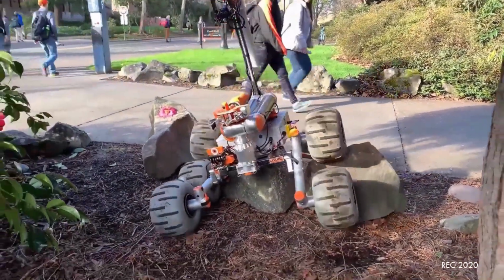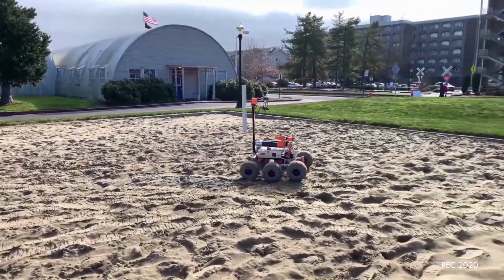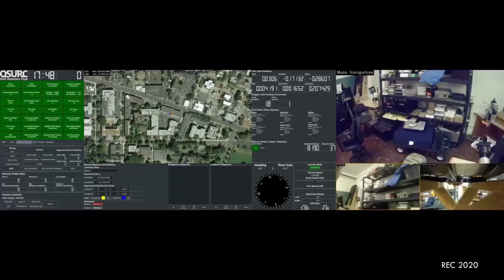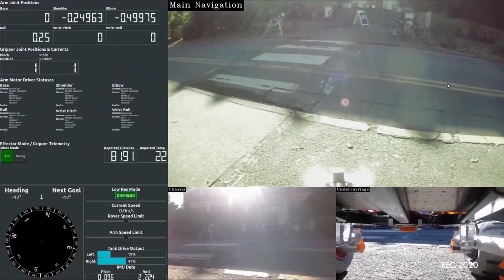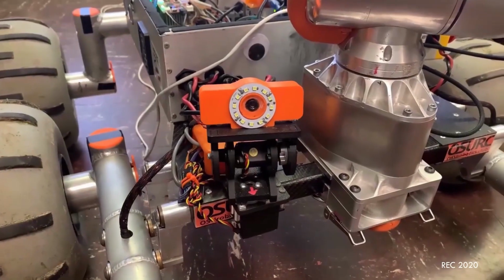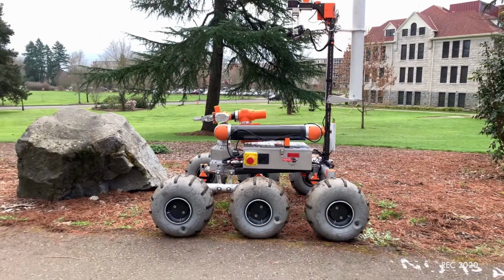The low-pressure pneumatic wheels and custom rubber tread increase traction and conform to rough topography. An IMU in the electronics box provides pitch and roll positions to the operators to ensure the rover is operating in a safe orientation. We have 3 cameras with active resolution adjustment based on available bandwidth located on the tower, at the front of the chassis, and underneath the e-box to provide multiple perspectives of the rover's environment.